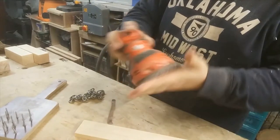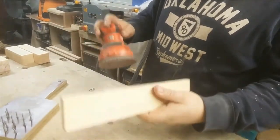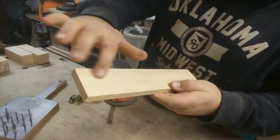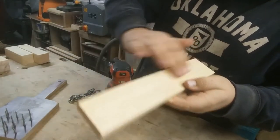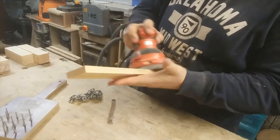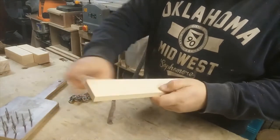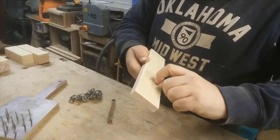I've done that. I've got my orbital sander with some — I think that's 120, yep, 120 grit in it. When you're bashing it up, it just raises the grain a little bit around the splits and the knots. Literally just a quick whop over, just to take them little burrs off the edge of the wood. Don't want to do it too much, otherwise you're going to sand them out because they're really shallow.